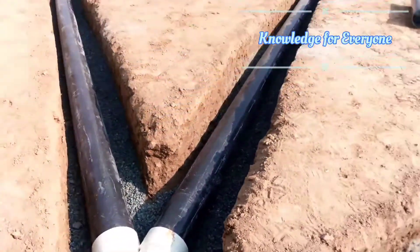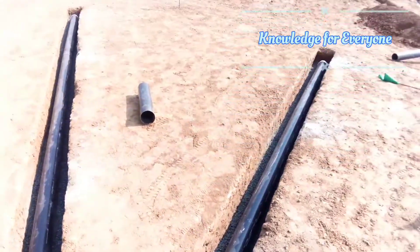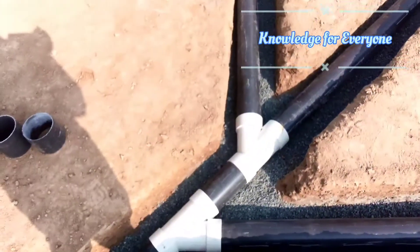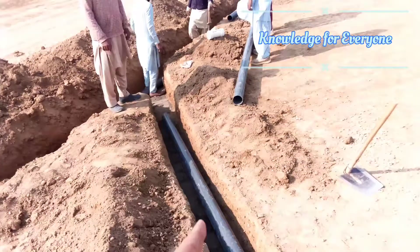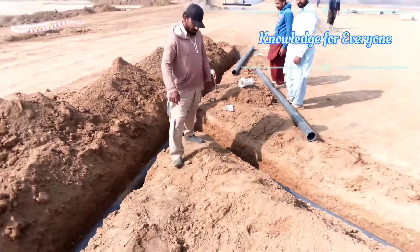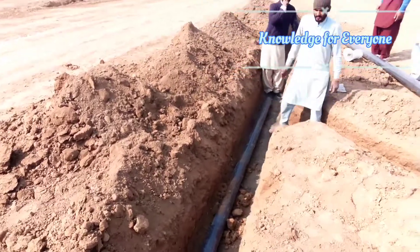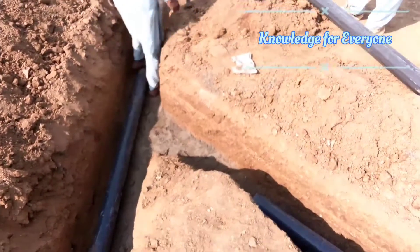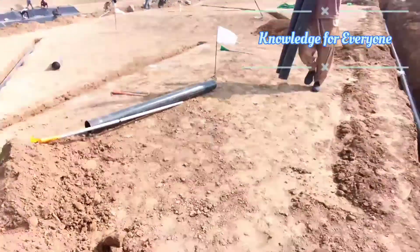We have a central line that is also filter, and left and right two laterals. Those will come to the center, and from here onward we have a solid pipe carrying away any excess water from irrigation or rain. Here is the main line and we will use a Y-T connection from there for this tee. Let me show you my third tee.